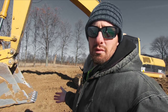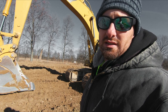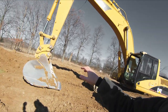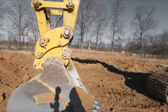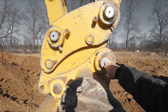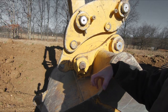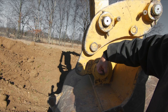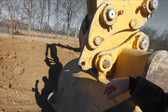The first thing we're going to do when we walk up to this machine before we're ready to do anything for the day is we need to grease it. I'm not going to go through every individual grease point, but excavators for the most part all have the same grease points. You're going to have two bucket pins, but this machine has a quick coupler on it. This coupler grabs onto these pins, so they don't need grease because they aren't physically moving.